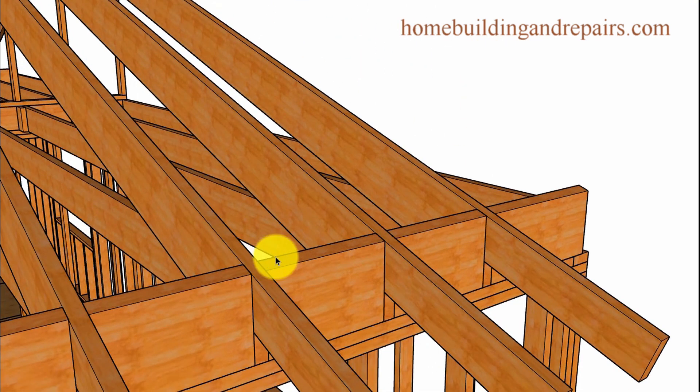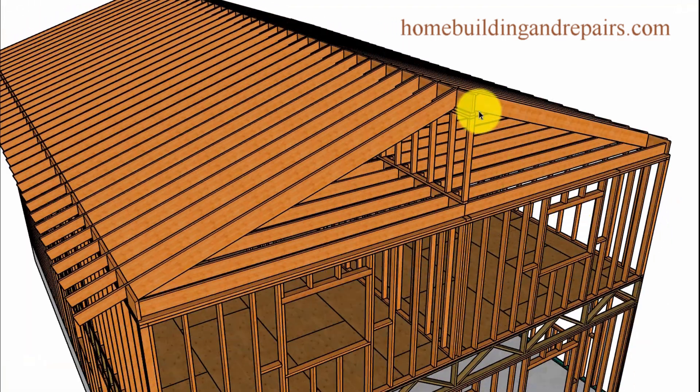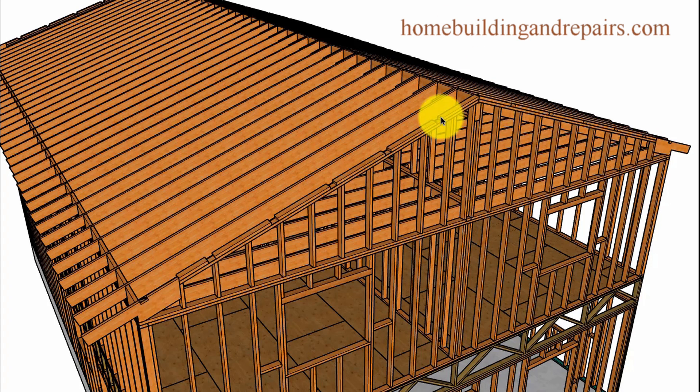Here's a view of that. The tops of the blocks are shaped — I've seen plenty of homes built without shaping the blocks on top, but it really does work out a lot better for nailing the plywood sheathing. In this one, I also went ahead and built a different rake wall, or end gable wall, and you can see there's a little rafter tail at the bottom.